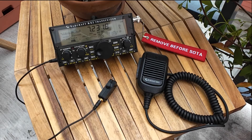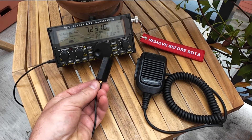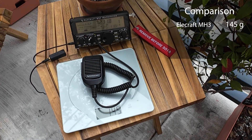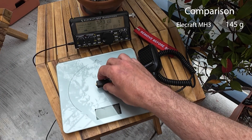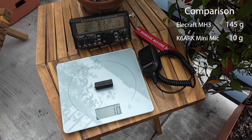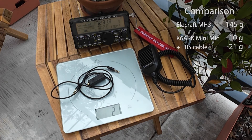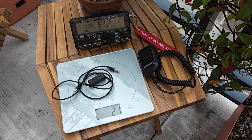That looks like a microphone. That was the whole build. We're back outside with the Elecraft MH3 microphone, comparing that to this ultra tiny, adorable little K6ARK device. The Elecraft MH3 comes out to 144, 145 grams on the scale. And the ARK microphone weighs in at a grand total of 10 grams. That's a pretty big weight savings. Even if you include the cable itself, that only brings you up to a total of 21 grams — so pretty incredible that the cable is actually heavier than the microphone. Thanks for watching, and thanks Adam for designing this beautiful little tool. I'm looking forward to getting it out on a mountain — if I ever decide to take a break from Morse code.